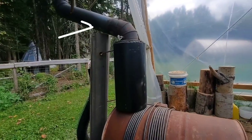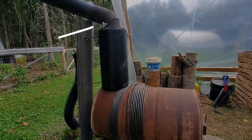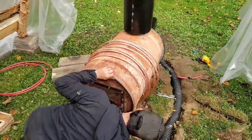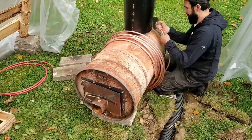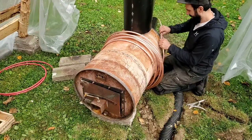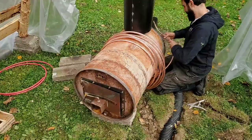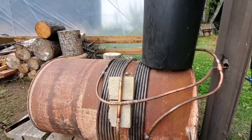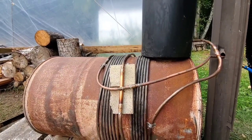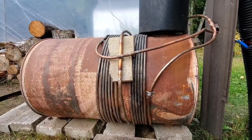This is how it looks when installed. I positioned the damper right above the coil to contain the heat in the first section. You probably noticed that I also have copper pipe wrapped around the stove body itself — that wasn't my original plan. On my first test, the coolant didn't get hot enough, so I thought some pipe wrapped around the stove body would preheat it, which actually worked well. The only problem was that I had soldered connection points close to the stove wall, which became hot enough to melt the connections. So I had to clamp fire bricks in between as insulators. Not going to lie, it looks pretty ugly, but it works.